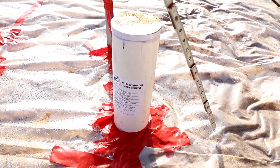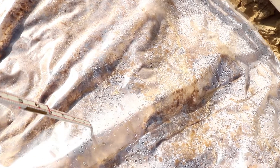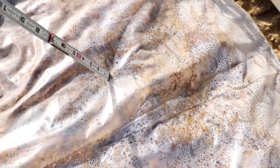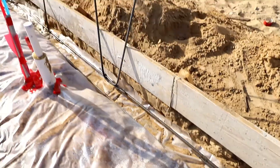You can see moisture underneath the vapor barrier when walking around on these slabs. This is also a good indication that we have a chemical spray on this soil. The particular location we're in today is on a sandy ridge — there's essentially no moisture anywhere else on this entire site. It's fine, light brown sand and it hasn't rained in at least three weeks. When we see the condensation and droplets underneath this visqueen, that's a good indication that the soil spray was adequate.